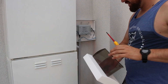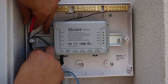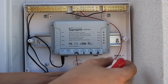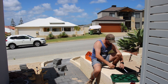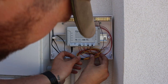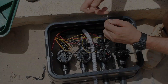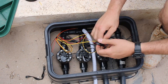I got excited and wanted to try out the first station, so I tackled the wiring. The shroud came with bus bars, so I connected the 24-volt AC power supply to two of them. I connected the common of each relay to one side of the 24V AC supply — all these smart relays do is pass AC to the solenoid when triggered. Using the blue drawstring I pulled five single-core cables through the conduit. Four cables connect to the normally open contact of the smart relays, and the fifth black cable goes to the return of the 24V AC supply. Back at the solenoid housing each relay shares the return connection and is connected to its respective control cable. I used blue connector points and electrical tape instead of gel-filled crimp connectors — it's what I had on hand.